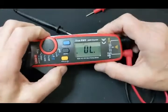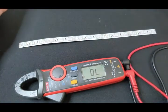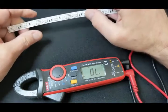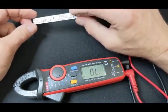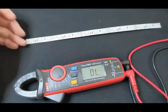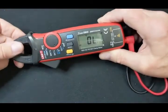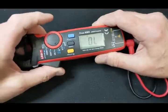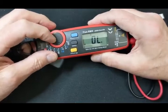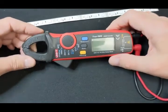I'll use voltage occasionally to test power supplies. What I want to do now is check accuracy. I know how many watts each LED draws, so with simple math we can find roughly how many amps they should pull. I think it's about 0.021 or 0.024 watts per LED — I'll look that up. Most meters, including Fluke and other US-made ones, are all really accurate. Chinese meters too — I've never seen one that wasn't accurate, even the bad ones. I've tested about 10 or 12 of them.